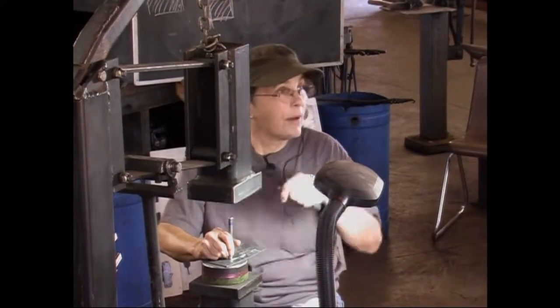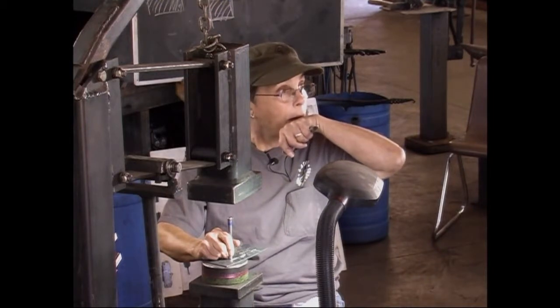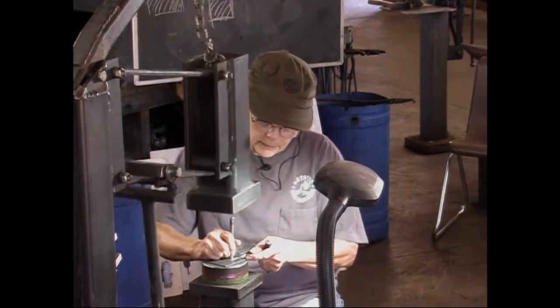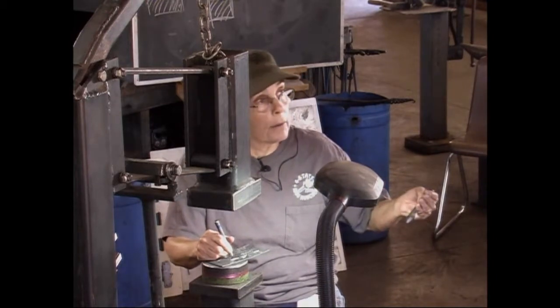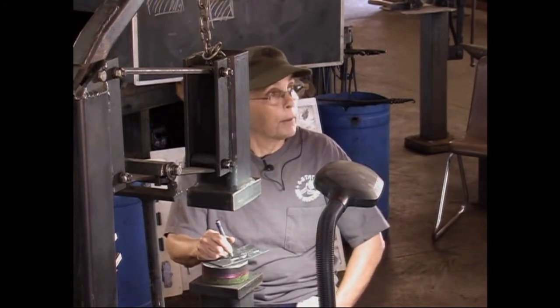And those were one at a time, not all three together, just to be clear. Brass brush, gun bluing, and heat. I've done a couple of pieces where I sand it all down to bare metal. I use the bare metal as one color for white, use a brass brush to color leaves with, and then I use gun bluing on the background.